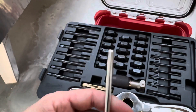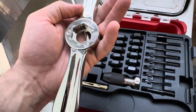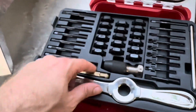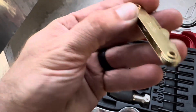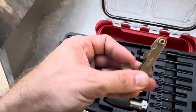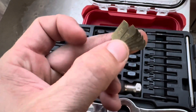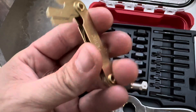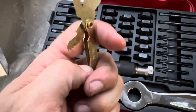What is this? What is this for? I don't even know — we're going to have to figure that one out. And this one should be for actually figuring out what type of threads we have. So this is pretty cool — it's like a little thread gauge, kind of like a feeler gauge if you will, but it's going to give you the different thread pitch sizes: 0.9, 1.0, 1.25, all of that stuff. And then we got the 2.5 thread pitch, which is pretty heavy duty.